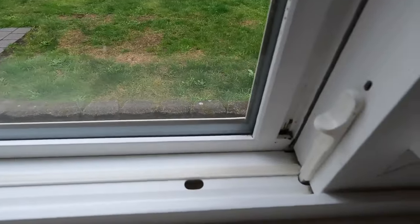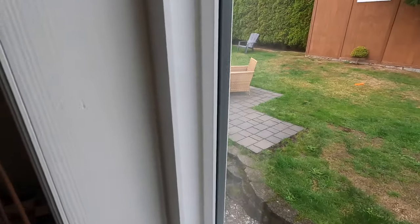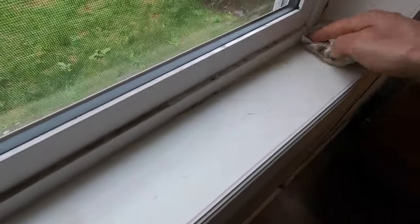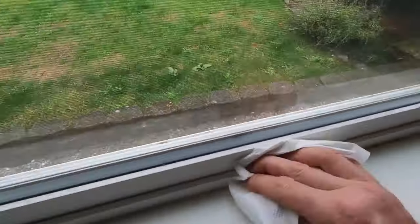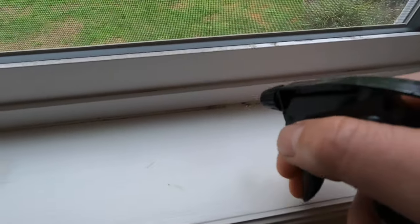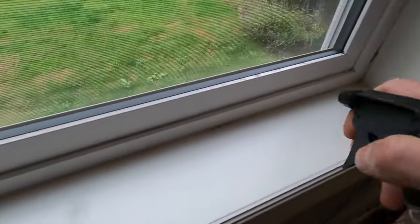So you can see that's already looking a lot better. I've got to get right in there and get that little bit. But as far as the long area, this is already looking really good. There are a few spots here that are being a little stubborn where the caulking is along the window, so I'm just going to add a little more and let that sit while I finish off the other spot.